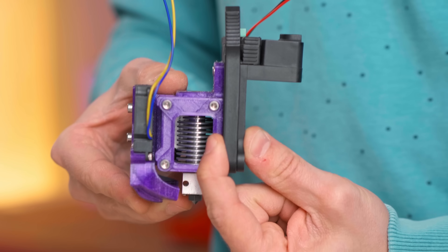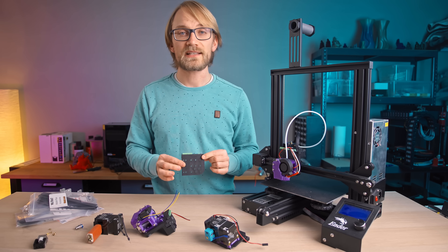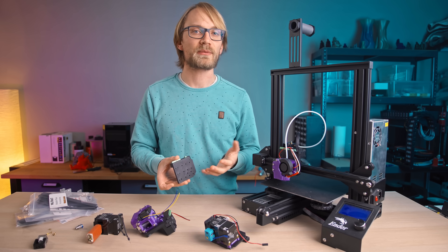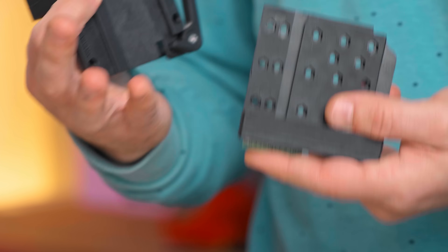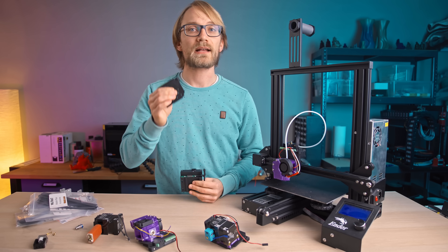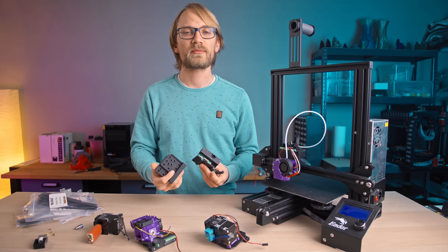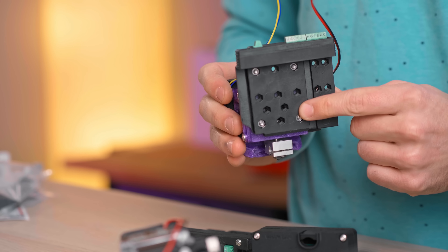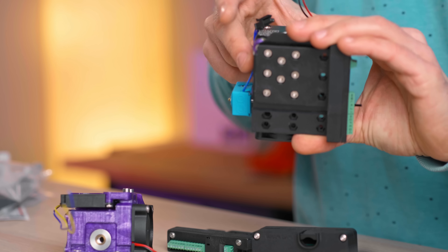The Mutant base is 12mm thick, but with a couple of adapter layers that easily gets bumped to 20 or 25mm. I kind of wish these mounting holes on the mobile plate were all just slots — that way they would directly cover a much wider range of mounting patterns. But thankfully, because this is such a solid slab of plastic rather than being hyper-optimized for injection molding and weight using ribs, you can definitely just drill your own mounting pattern into it. The pattern that comes stock has pockets for M3 hex nuts in the back — I think square nuts would've been nicer as they would also work better with slots — but you can use these pockets both with a nut to screw into the plate, or you can stick a cap-head screw in the back and screw into a hotend or extruder that already has threads in it.